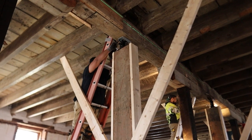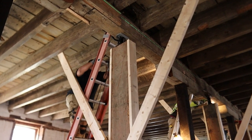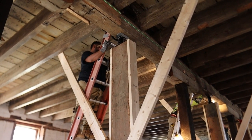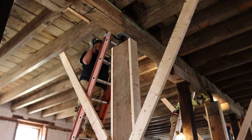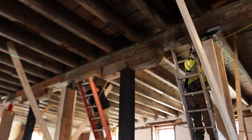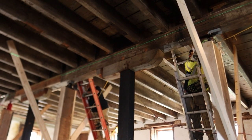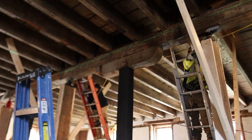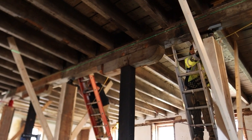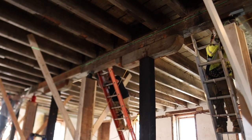Yeah. You see these angle braces coming down. They seem counterintuitive. They seem like they're upside down because as you lift them, you change the angle of those braces. For a short amount of distance, it's not a big deal. Nothing really is affected by that. But if you were to go more than, say, 2 inches, which in our case we did 3, a lot of those had to be reset. The angle changed enough, and it was fighting. The braces were fighting lifting the floor. They were holding it back.